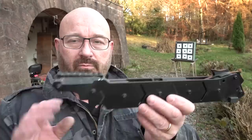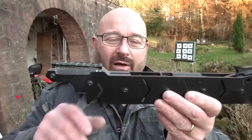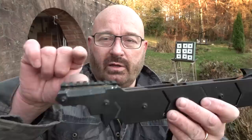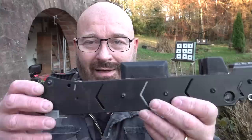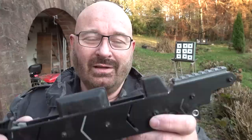It's also made from aluminum, powder coated. So it's actually higher quality than the original one. But of course, it's also more expensive. Now, 7 shots is better than 5, but it wasn't good enough for me. So I found that I could probably increase the height of the side walls a little bit, so I can put a few more arrows in without blocking the line of sight for the red dot that attaches to the Picatinny rail here. I did this a while ago, and it works. It now holds 10 rounds, which is a lot better than 7, but not good enough for me.